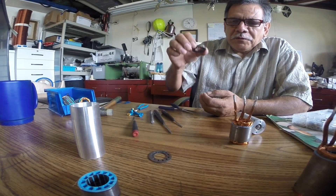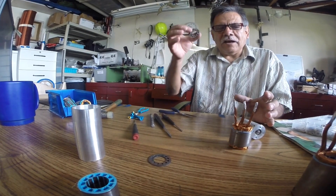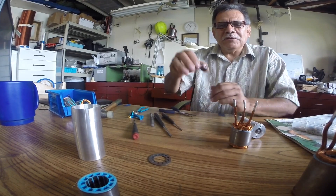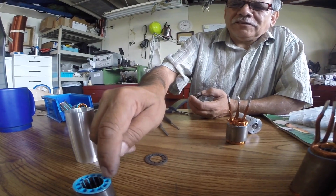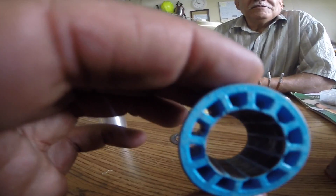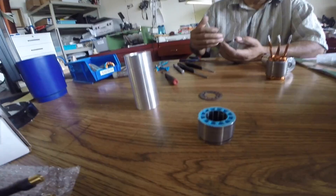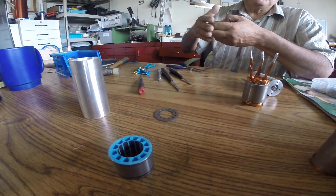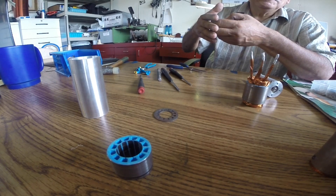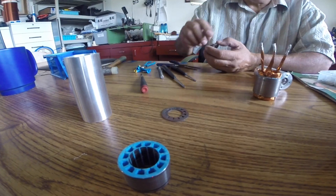Because if you put it too long, you get too much and the slots get clogged. And if you put too little, it's too thin and it's going to make it short. When you put the wires in, the wires are going to be scraped against the metal — the part that has no coating — and it's going to make it short. So this is very, very touchy, and not everybody can do it.